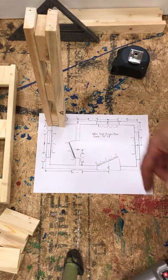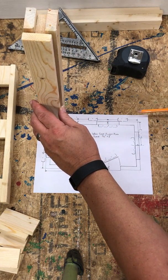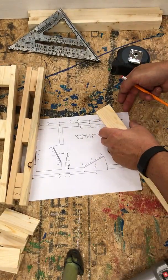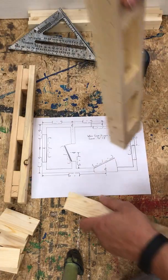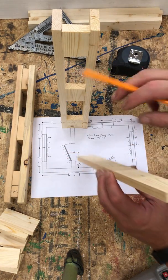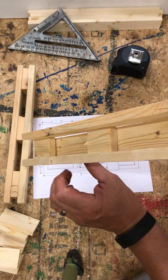You build your long walls first. When you build your short wall, you put a single common stud at the end, and when it rotates up it nails together to make a corner so you can hang your drywall material. Where two walls come together at a partition wall, you make what's known as a T — it's T-shaped from the top. It goes in the middle of the wall with a common stud, another common stud, and three filler blocks in a different orientation, locking the walls together to give you room to nail and also to run plumbing and electrical.